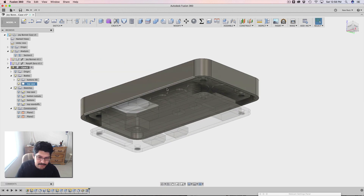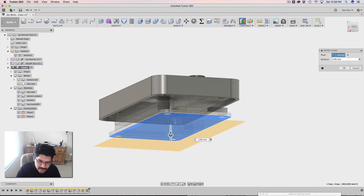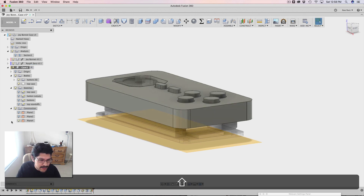The first thing I'm going to do is click on the bottom of the Raspberry Pi. I want to work off of this surface because if I ever need to change it — if the Raspberry Pi is too far or too close to the Joy Bonnet — I can just update this offset plane and not have to worry about updating sketches. So over here under Construct is Offset Plane. I have that selected. Now I can drop this down — this is going to let me create some distance away from the actual PCB. I'll put two for now. I think that's going to be okay; super easy to change. So I'll hit okay. Now I have my construction plane called Plane Four.